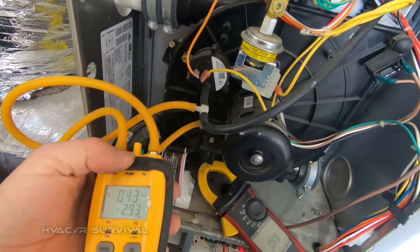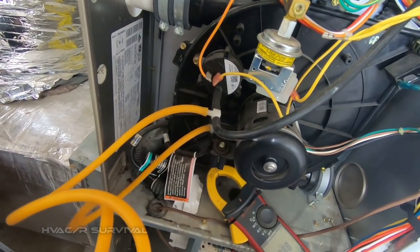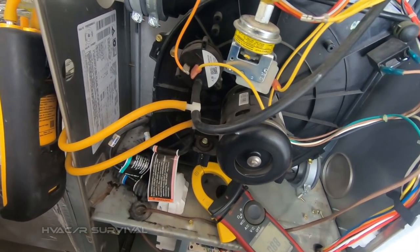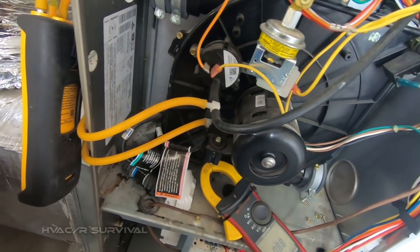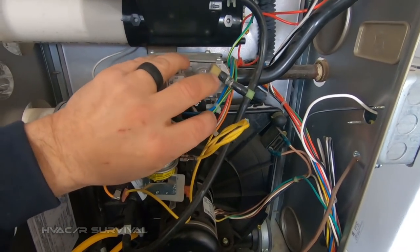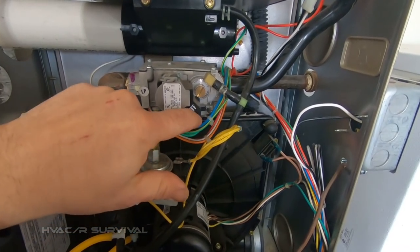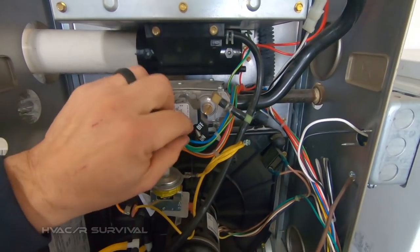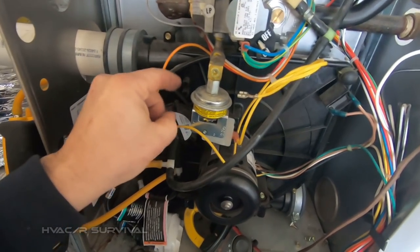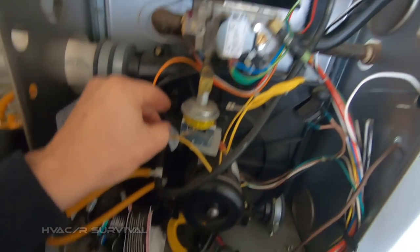Give the wires a little tap — a little shake of the wires. Kind of just tap my switch a little bit, because these are little things that sometimes if they're just barely making contact they'll act stupid. Tap the switch; if it's just barely making contact internally it would drop out. We're not having any of those issues.